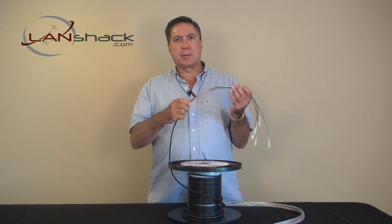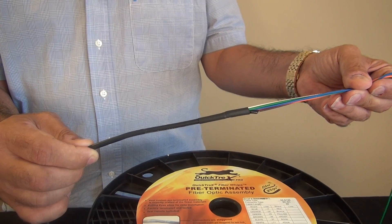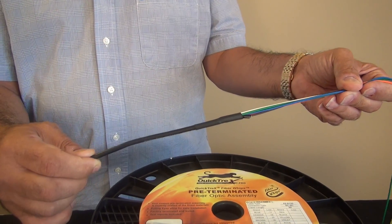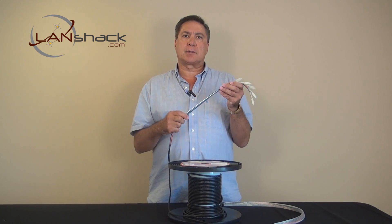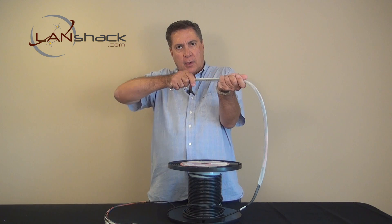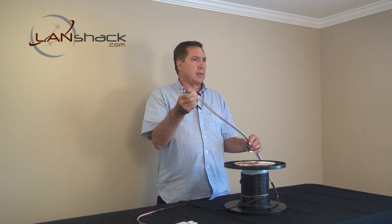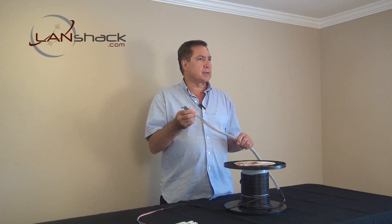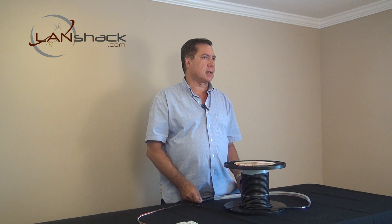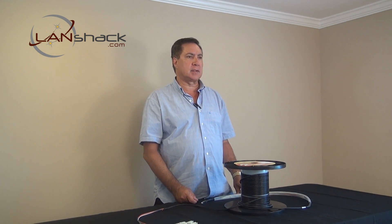Ends of the buffer tubes are brought together and secured with glue set heat shrink tubing for added strength. The fiber strands and connectors are covered with a super strong polyester monofilament sleeving that tightens itself when pulled. The connectorized ends on a multi-strand fiber are wrapped with a clear stretch plastic to provide a barrier against gel and other possible contaminants during installation.